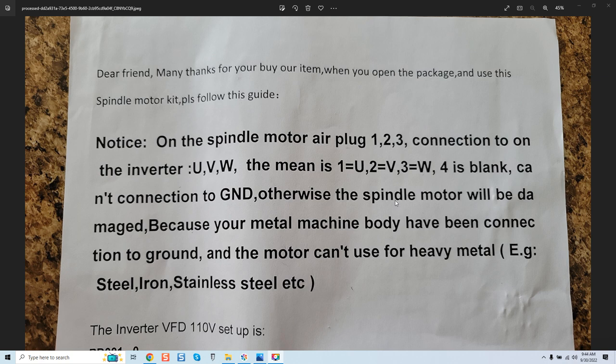This is simply not possible. I have never heard of this, never seen this, and I don't know why this would be written. The potential client went back and spoke to the company, and they said it was precautionary — but it's not precautionary, it's ridiculous. The bottom line is you're not going to cause a ground loop by using the ground on the VFD, because every ground on that VFD terminal supplying a ground signal to your spindle is going to be shared with the VFD. They're all using the same ground.